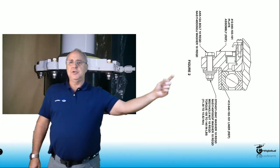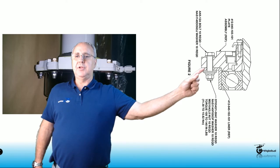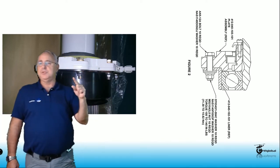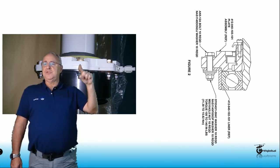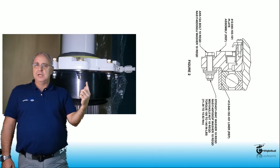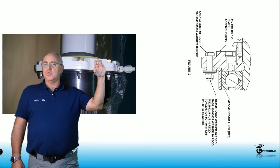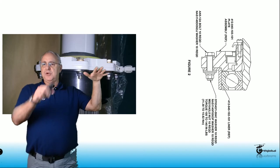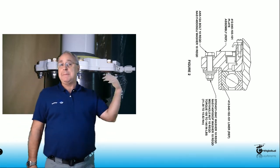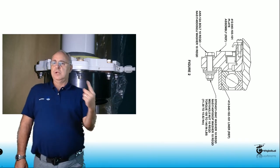When you flip everything around, this is the configuration: ProSeal is going to be installed on the retainer plate contacting the liner made of steel. When you are going to assemble and install this in the helicopter, you remove the temporary bolts. Good practice — as stated in the manual — is to install it first, squeeze everything, and then install the four countersunk screws. In the past people would try to press this together using the countersunk screws, which is wrong. My advice is to press it by hand until you have no gap, then install the screws.